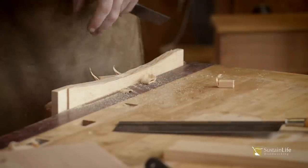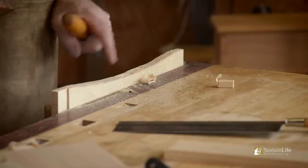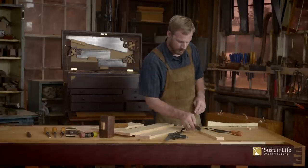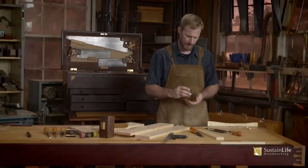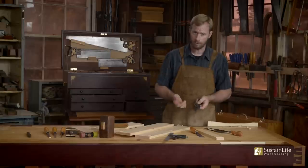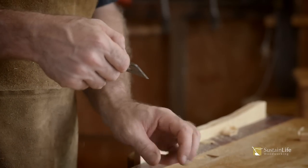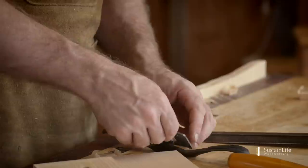That's how we cut an arch using the stop cut method. Now this is somewhat rough, and even if you did cut this out with the bandsaw, you'd still want to smooth it out. That's where the spokeshave comes in, which is essentially just a mini plane. Of course it needs to be sharpened, in exactly the same way that a plane is sharpened. The blade goes in beveled down — that's the angle, beveled facing down, and it goes in the shave like this.